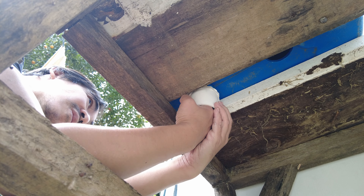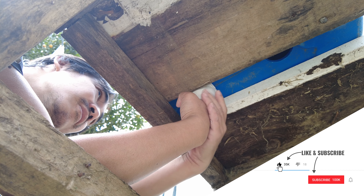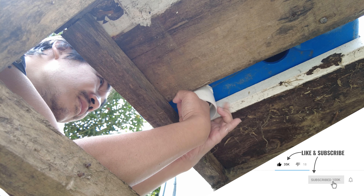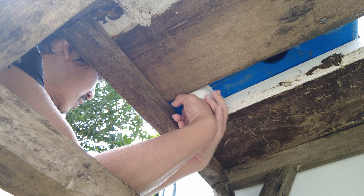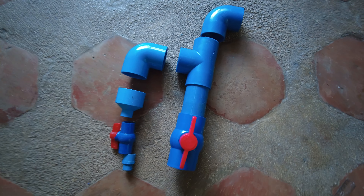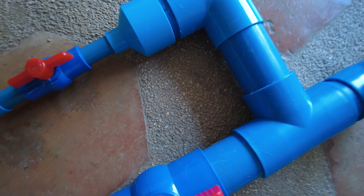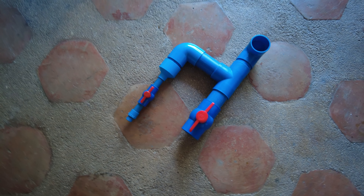From the bottom of the barrel, I then screwed a 2 inch female conduit adapter tightly, though eventually I had to seal them around with marine epoxy. I did this for both holes, but only one of them had the long PVC drain pipe. Going back to our PVC fittings, I'm using both 3/4 inch and 2 inch sizes, splitting with a T-fitting, then using a reducer to go down to the 3/4 inch output line.